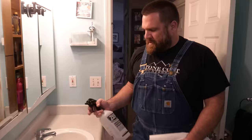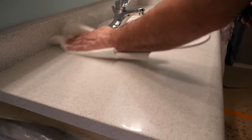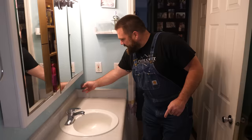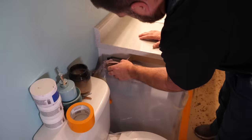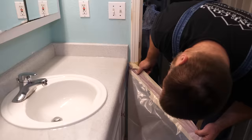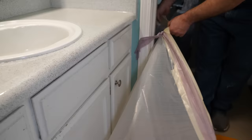Sanding is complete. I'm going to wipe and clean the dust with some 91% isopropyl alcohol — a quick little misting and wipe. I can't believe how pretty that backsplash looks. It's an okay time to get rid of your masking now because the Ultimate Top Coat is not a messy process. I am though going to tape one row of tape up here so I don't get any on that paint. Using that delicate release tape means even if your cabinets aren't in the best shape, you're not going to pull any paint off.